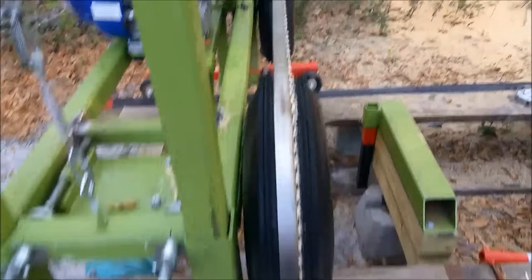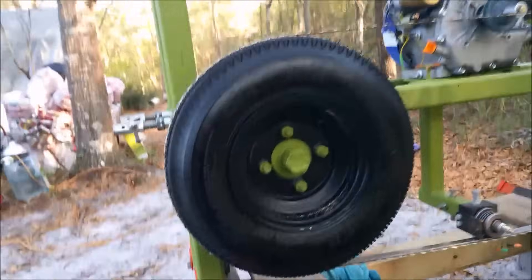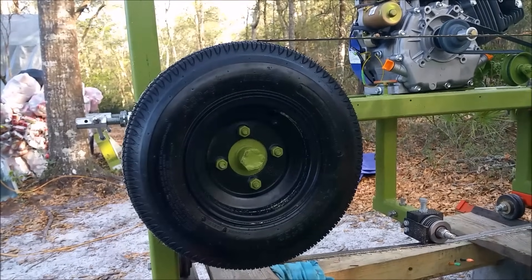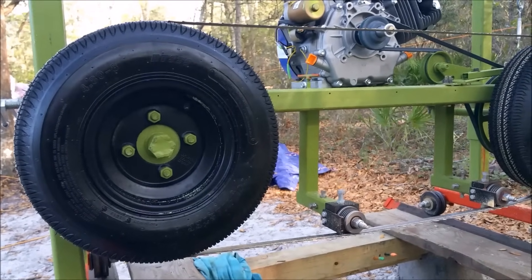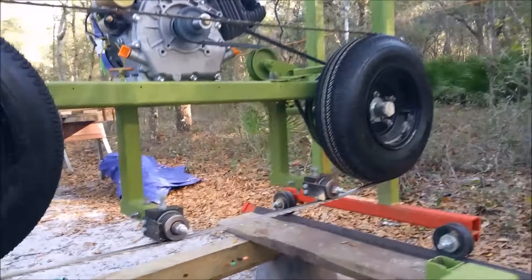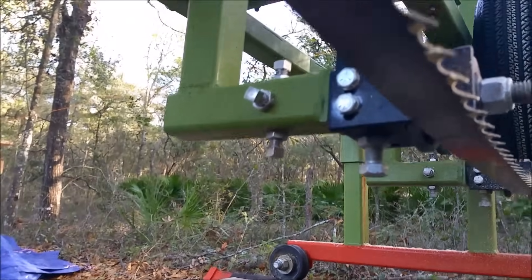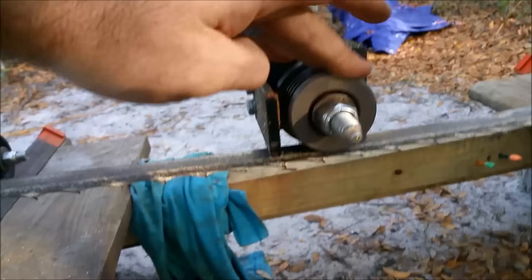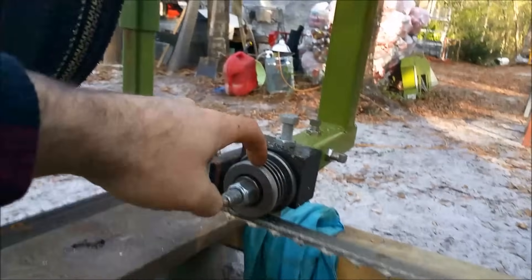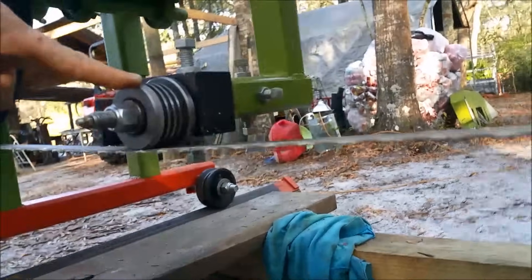The wheels are about sixteen and three-quarter inches from top to bottom, blade to blade. These are smaller wheels — I didn't want huge wheels on here. These are Cook's complete blade guide assemblies with multiple adjustments — top, bottom, sides — and a grease fitting. The bearing itself is roughly two inches as advertised, and you can see adjustments in all directions.